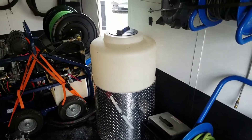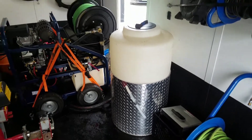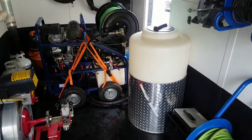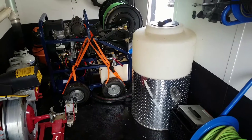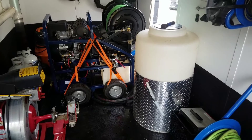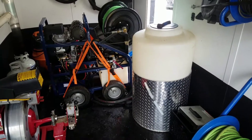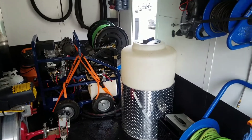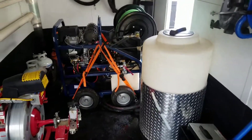Got a 65-gallon storage tank for running the Jetter. Our fill reel fills up the tank, so we're running off of that. We get some pretty good jetting times out of it, even with a Warthog on there. If we're filling at the same time, in a house you can pretty much just keep on running because you're starting and stopping, positioning and things like that — it works out pretty nice.